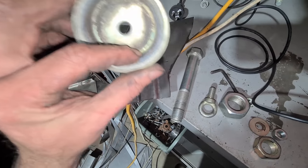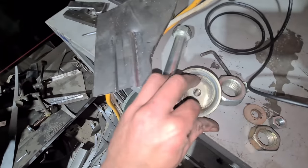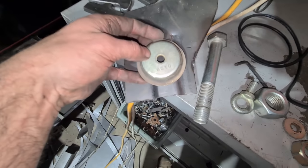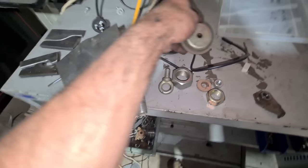This is why I always keep random bits in tubs and boxes. I'll use this as the upper die — I'll fill it in with some weld to suit whatever radius I want but it should be pretty close after some cutting and shutting. Better than starting from scratch anyway.